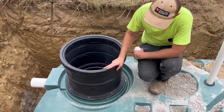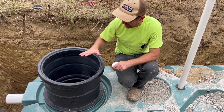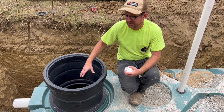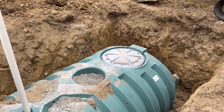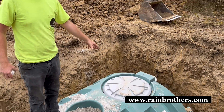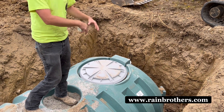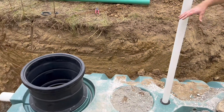Finally, we have our riser for the cistern. In this case, it's a 15-inch manhole extension. We're just extending the lid — the access — on the side of the tank that's directly over our pump. That way, we have quick access if we ever need to service, maintain, or replace that pump. On the other side, we're going to leave that lid on the tank, and it is siliconed down. We remove the lid, apply a bead of silicone, and then refasten the lid. Even though that lid has a gasket, we always like to use silicone as a secondary measure to protect the tank from getting groundwater inside.